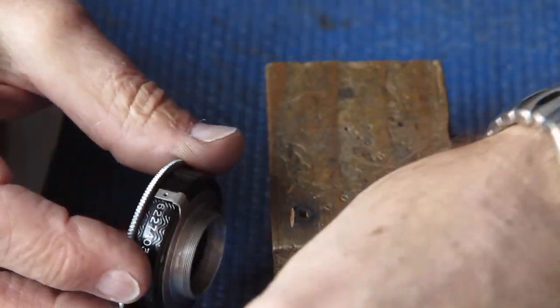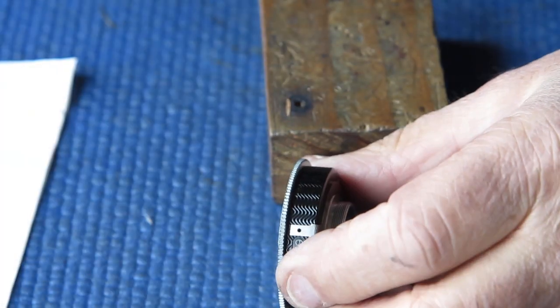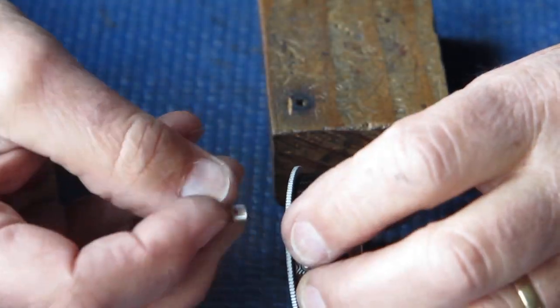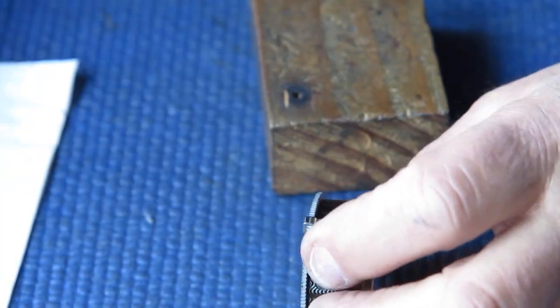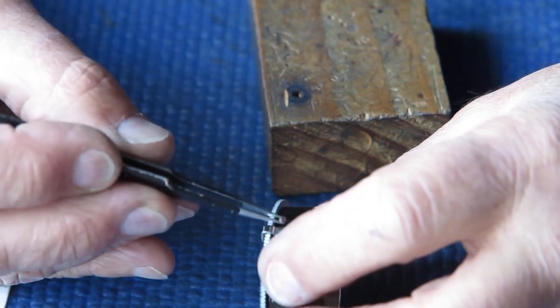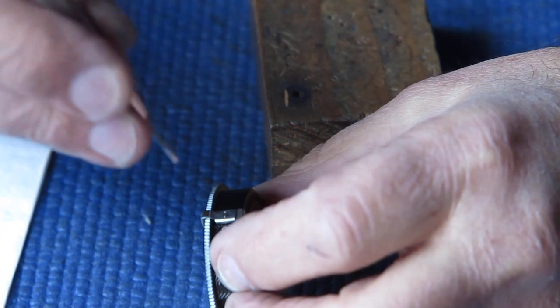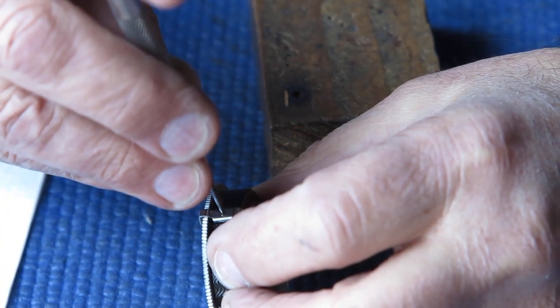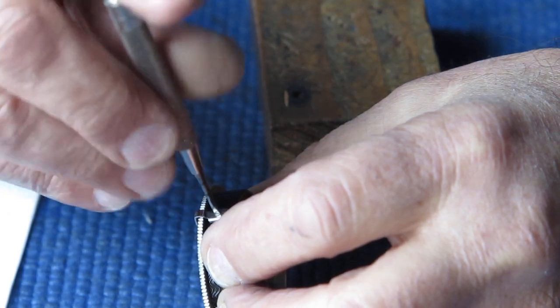So the shutter - there was nothing broken in the shutter. The shutter failed to function because it needed to be serviced, and specifically it needed to have oils and greases removed from where they shouldn't be, and any dust and grit washed out.